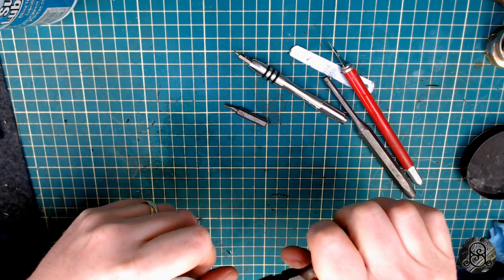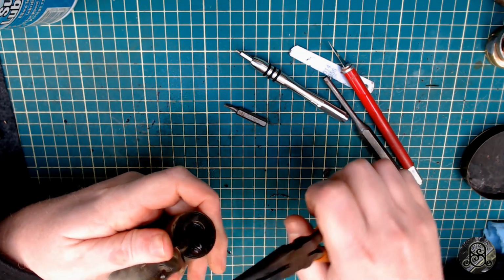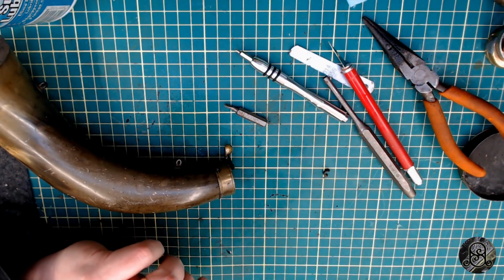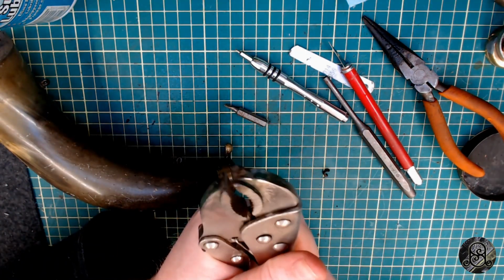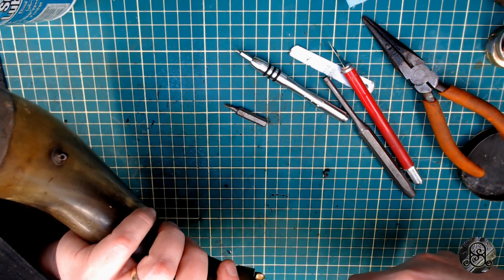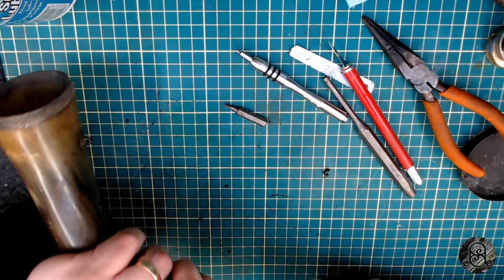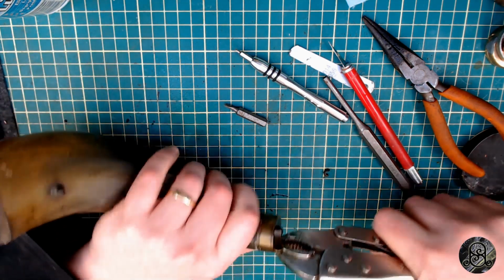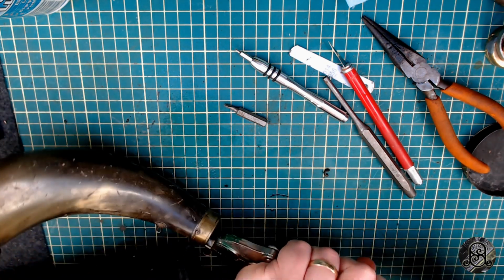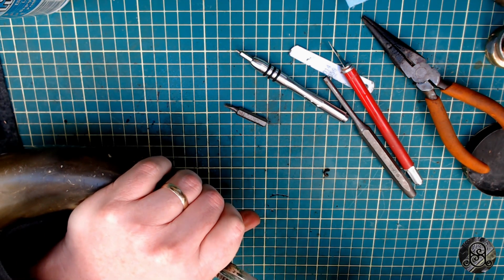It's this screw. The screw has got the biggest attitude, but it could be what happened here was the classic different materials. So brass and steel will tend to, with moisture, seize up to each other. Get my big boy vice grips. I'm going to grab that head. Clamp, slight twist, clamping off center, and you can see it's off center, kind of, let's see, it does feel like it's starting to move, so that's good. Yeah, it's starting to move, so let's see if I can get it with a screwdriver now.